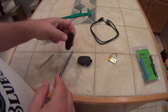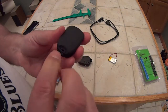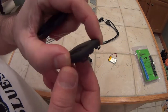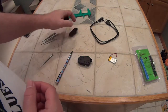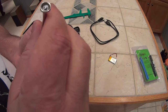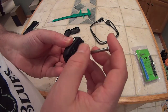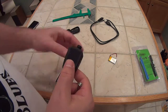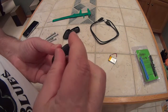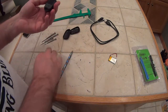Here's an empty case — I had an extra case with no electronics in it. What we're going to do is take out the two screws and then push the case forward, because there are some latching tabs right there. Using a jeweler's screwdriver — I had loosened the screws before I started filming so they should come out pretty easily. There's one, and the second one.